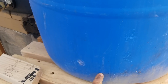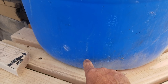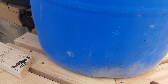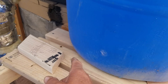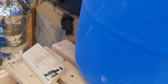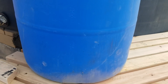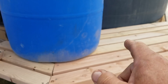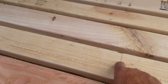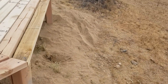I'll be drilling a hole in the bottom of each barrel, right about here, and putting in a PVC threaded fitting sealed into the unit so it stays there. Then I'll be running 1-inch PVC pipe from one unit to the other, all the way around. I estimated by using a stick and put marks on here to measure the width of the barrels going all the way around, and it'll hold 14 barrels.